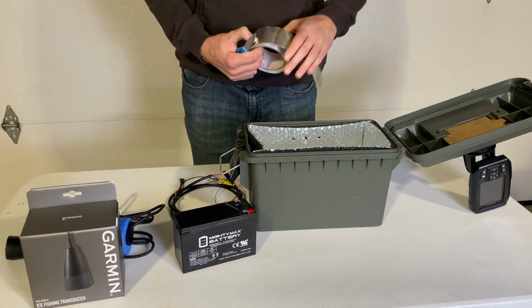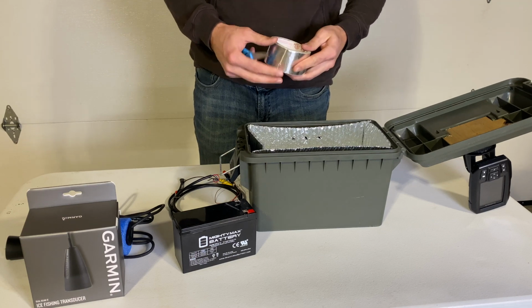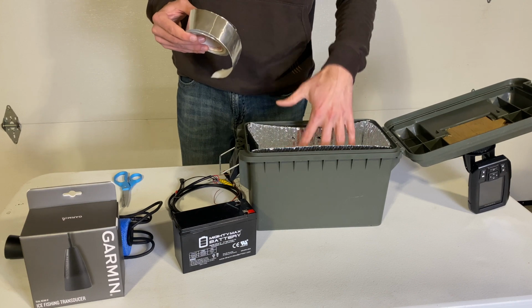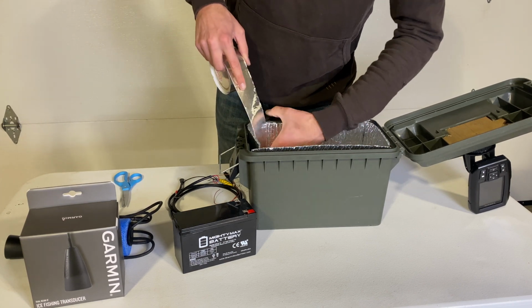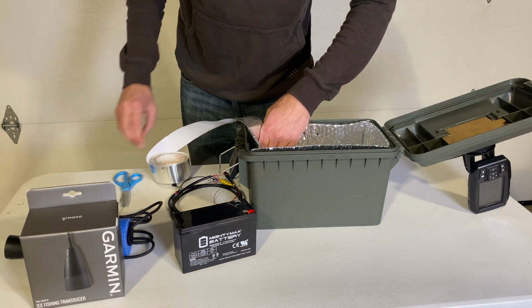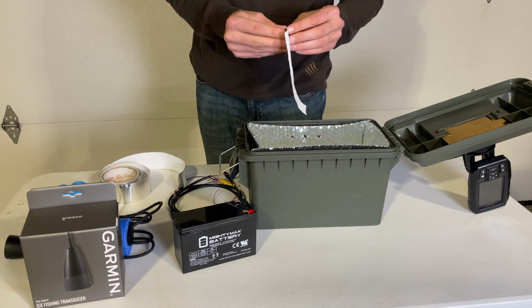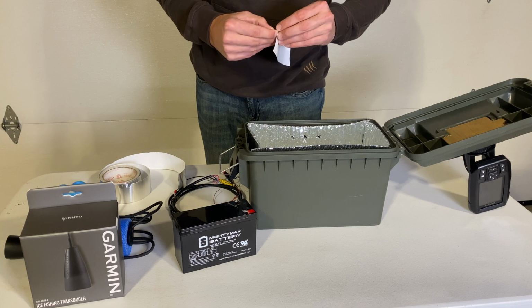Okay, so what I'm going to do, I have some foil tape. Again, I'll link it in the description below, but Home Depot, Amazon, pretty much any home improvement store will have this stuff. All right, so what I want to do is foil tape the inside seams while it's in here so it stays in a rectangle so it's easy to pull out. So what we're going to do is just measure the length. Place that off to the side, and we'll just cut it here. And then this has the paper backing on it, so we're just going to peel that off and get going on this. I'll speed this up.